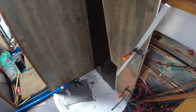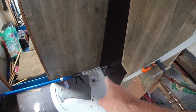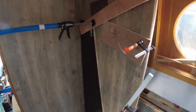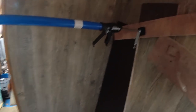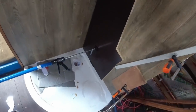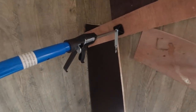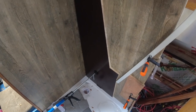That's pushed in now. I've put a little brace in there to stop it bowing - the bottom one is pushing the board and bowing it at the bottom, and the top one is bowing it at the top as well. So I've got a fair bit of clamping pressure in there which I'm happy with. Really it's the seal along the bottom and that corner that's the more important bit for leakage, so I'll put plenty of sealer down at the bottom and side edge.